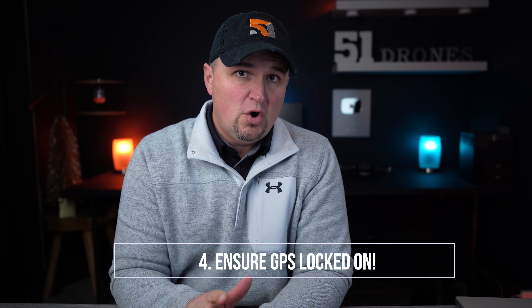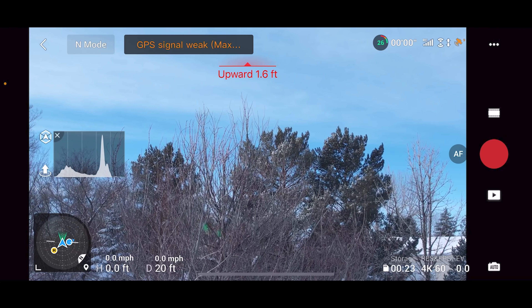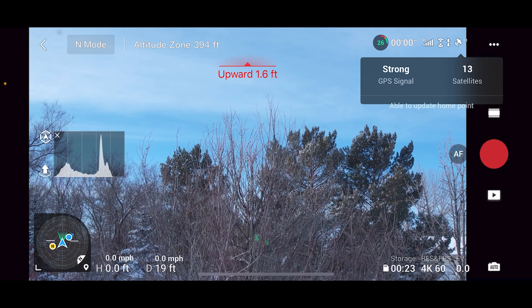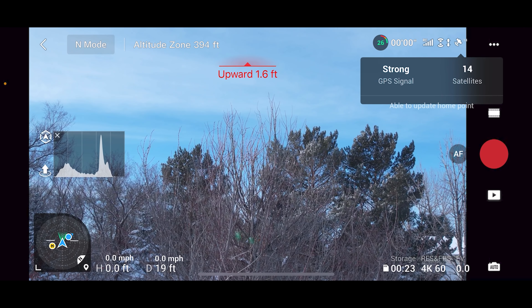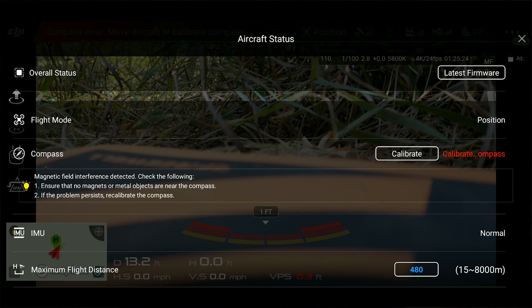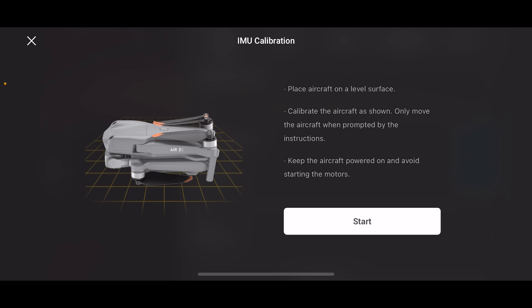This next step is very important — another thing that if not done properly can cause a GPS drone to crash. Wait until your drone has GPS connectivity. It will show you on the app interface how many satellites are connected and it will tell you audibly that the home point has been set. This means that your drone will fly steady and stable. Launching before that is very risky, so wait for it. If it doesn't ever gain GPS connection, I suggest moving to a more open location with less interference. Basically follow the prompts on your app — if it tells you to calibrate your compass or IMU, do that. The software will always advise you when something needs to be done, so trust the software.